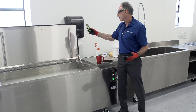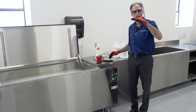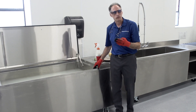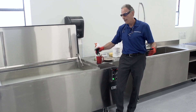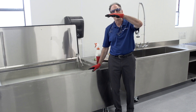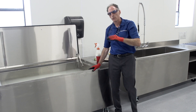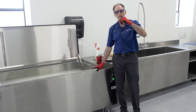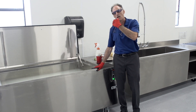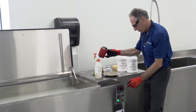This particular bath reads at 11.3. I'm going to write that number down for this job. When the pH drops half a point — down to 10.8 — that's when I need to add more soap, about another half gallon. Mix it in, take another pH reading, and you want to see it bounce back up to about 11.3, maybe 11.2. If you can only get to 11, you'll need to add more soap. If you don't have enough pH in the bath, you're not going to clean properly.